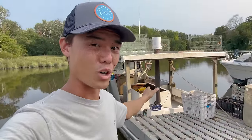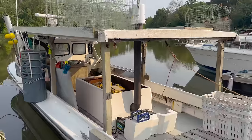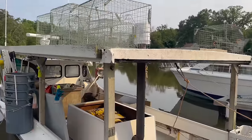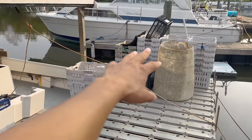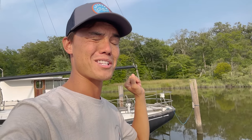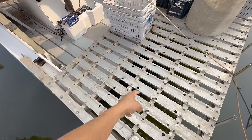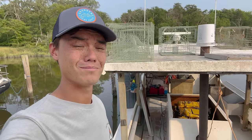I've also done a tremendous amount of work to this boat. I have the back rack, which I built out of garbage — that's not stock. We have a fiberglass and wood roof for stacking crab pots on top. It also makes a nice place for your old lady to sit and get a suntan, but it's a working surface. We can stack pots on the rack and on the roof and move about 175 crab pots at a time with nothing else. In the beginning of the year when we're setting with all the stuff we need to harvest crabs — the tank, the burner, the crates, extra pots — about 75 pots safely, which means we can really fit about 125. The rack actually makes my 34-foot boat about 36 feet long — I made it three crab pots deep and five crab pots wide. And if you don't use crab pots as a unit of measurement, you ain't no crabber.